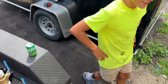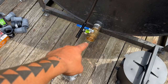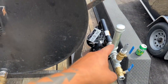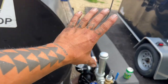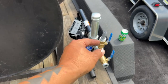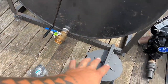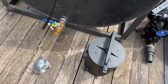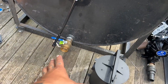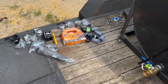So I've got the Boy Wonder here and we're going to learn to put this thing together. First thing is I draw a diagram coming from the outlet to our filter basket, from the filter basket to the pump. This is a surge bottle. We're going to build it up higher, and then this goes to the spray hose, and this is going to get turned into a two-inch return. Do yourself a favor — draw it out with all the pieces. You usually never get it in your first shot, so lay it all out and then go into town.